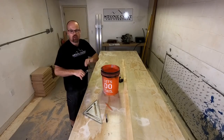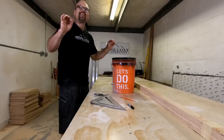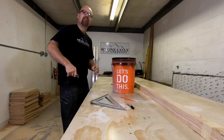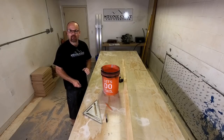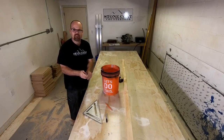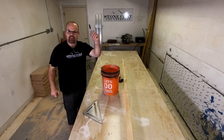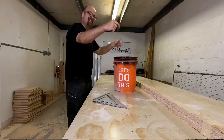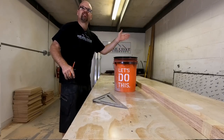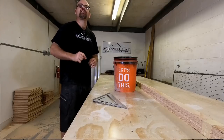Also bring your knife with a brand-new blade. Get template material as thin as possible — it'll still stay together, and you can razor-cut it right in place without going back and forth to your saw. Bring a pencil and a Sharpie. The Sharpie lets you label your template and make notes: Is this next to a fridge or cabinet wall? Is this the center point of the sink? Is this sheetrock or tile? Where's your setback? All those things are important.